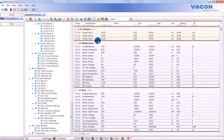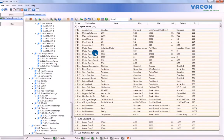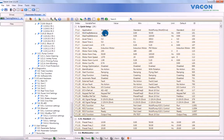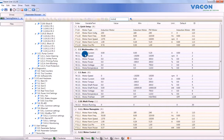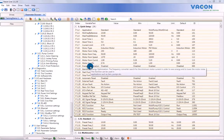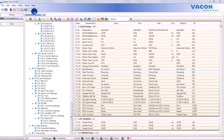All the parameters and attributes are shown clearly in the VaconLive parameter browser. A number of features here make it easier to manage the various values. For instance, you can edit the parameters simply by pressing Enter on your keyboard, which takes you into edit mode. From here, set a new value and press Enter again to confirm. Alternatively, you can simply type in the name or ID number into the search bar at the top of the screen. Just like when using the keypad, help texts are provided for each parameter and monitoring value, giving valuable explanations for the things you might be unclear with. For more in-depth guidance, you can access Help by pressing F1.